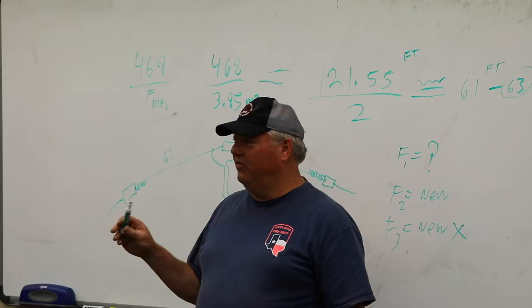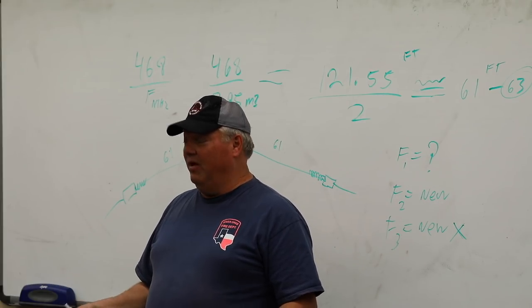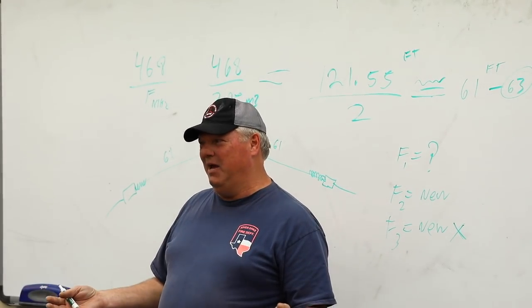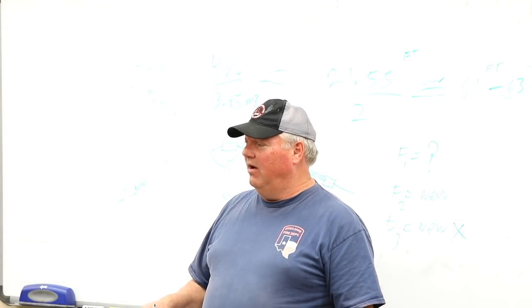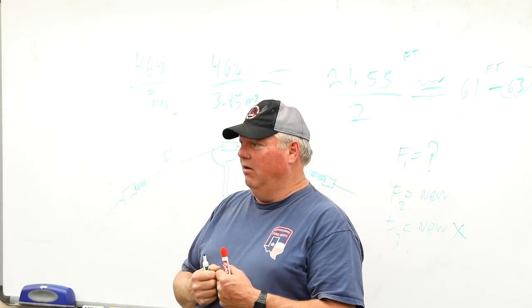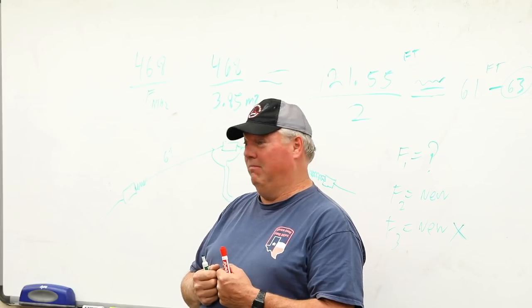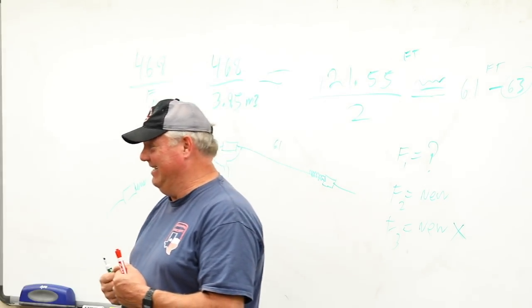I ran the thing, I ripped out, and I put my meter on it, and it said 50 ohms. And then nobody could hear me very good. I was hearing people okay, but not that great. I go, man, I got 1,000 feet of wire out there. So I grabbed my multimeter, just a dumb ohm meter, and I put it across the leads. What do you think I read? Zero. 50 ohms. Really close to 50 ohms DC.